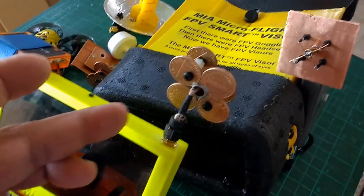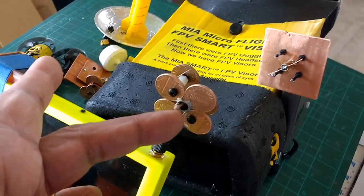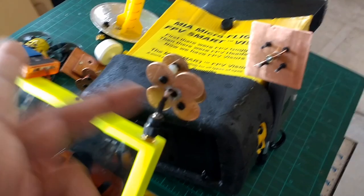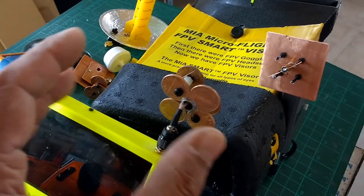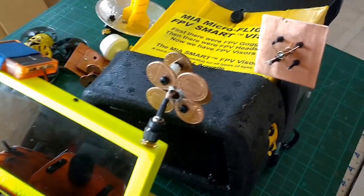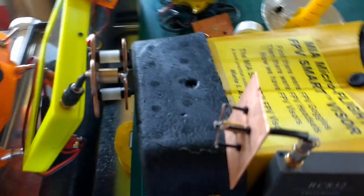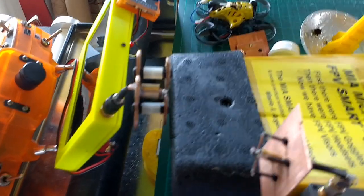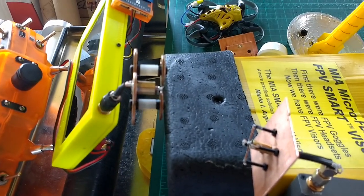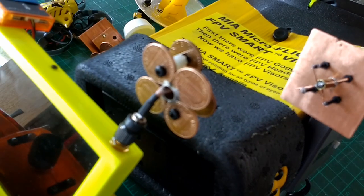But anyway, because of the four pennies here that act as reflectors and have a spacing here, 5/16 was the diameter to allow that to sit nice and snug in there. And so that's why I used that dimension there. And so you can see the balun from the side here. Now, inside the balun, you have the coaxial cable, which is run through, and it's grounded at the base via the back plate. Very similar to the way this antenna is done.